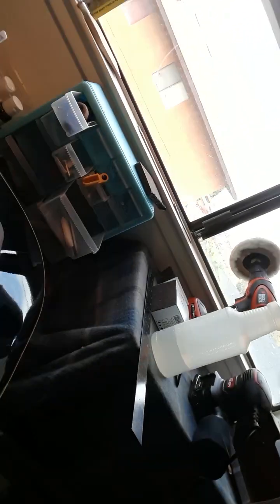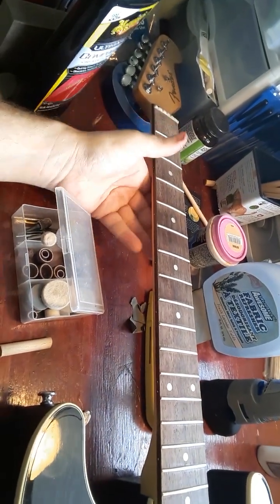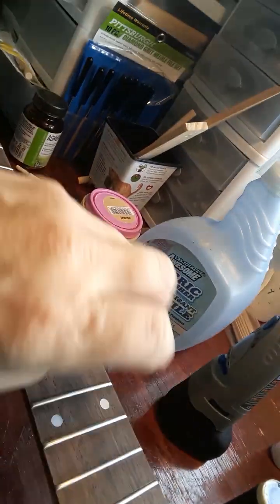It does feel sanded — I'm pretty sure I got like a 1500 grit and it still keeps like a satin shine on there. So I never really removed all the satin finish. But it plays really good — it's not like the poly where it gets really sticky. It feels like my Strat where it's down in the wood. And then I'll do butcher's bowling alley wax on the back of the neck. We're going to go boiled linseed oil.